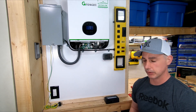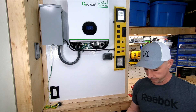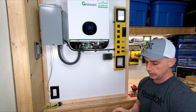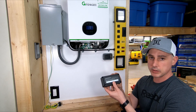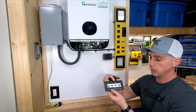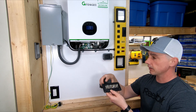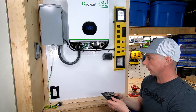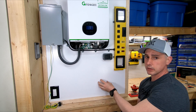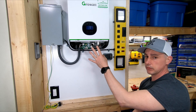For my DC inputs I've already gone ahead and made up all the cables that I need. I'm going to be using a couple of bus bars — this one's black, the other one I have is red — and this is going to protect my bus bar. I'm going to have multiple battery connections here as well as my cable running up to my Growatt. I've already mounted the screen for my shunt, so now I'm just going to mount my two bus bars, my shunt monitoring device, and my main disconnect for the inverter.